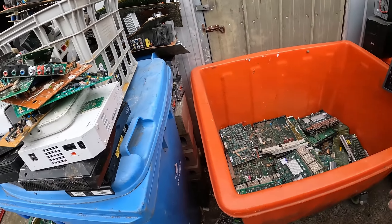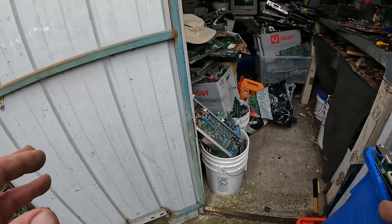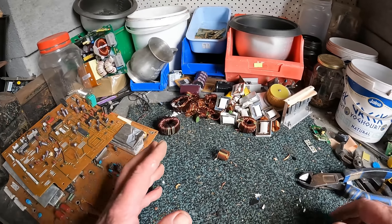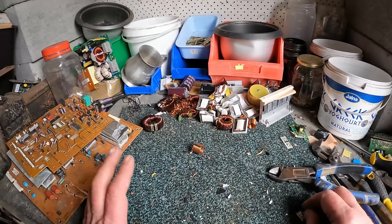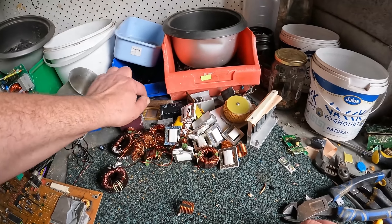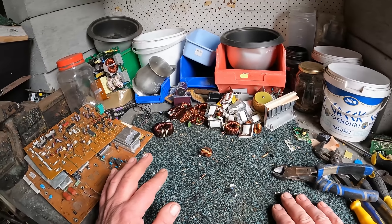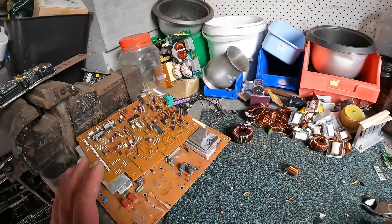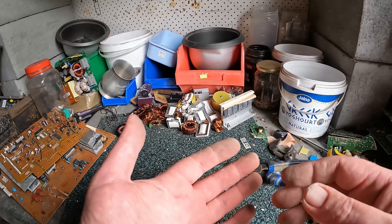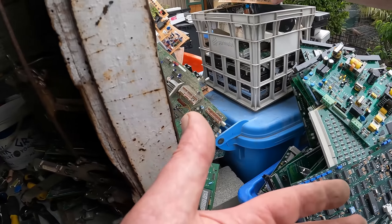There we go, two pieces. A lot of cases they've got this little black stuck-on piece of glue probably just to stop them from uncoiling. Two pieces you can throw into your burnt copper or number two copper. It actually does weigh quite a bit - if you've got a bucket full of this you'll know about it. I see it so often and think why not just take off these copper coils? And even if that's all you took off and threw the rest into scrap steel, you're still much better than selling it as a low-grade board.